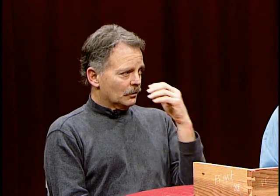Yeah, exactly. So as a basic amateur myself, I'm sitting here thinking, do you veneer and then join something together, or do you join things together and then veneer? Well, you're creating a panel generally with veneer, and so how that panel is joined is not the same. Most of the stuff we've been talking about in our previous discussions about joinery is using solid wood. We're not talking about joining plywood. You can kind of look at what we're talking about as creating our own plywood.